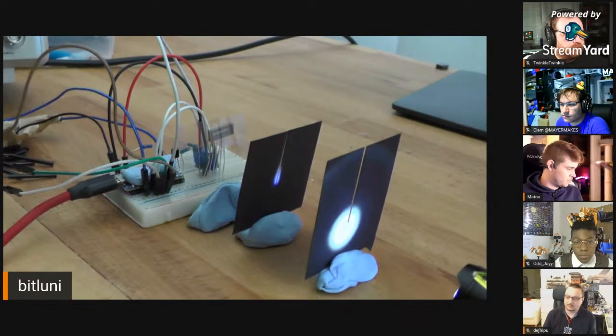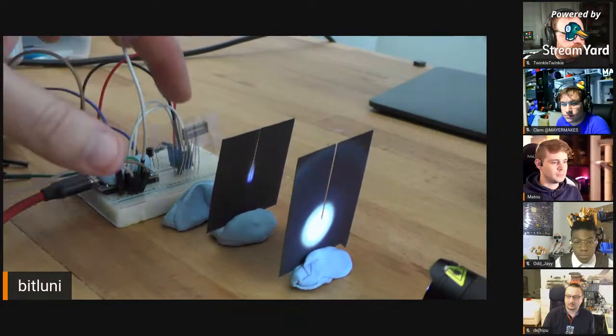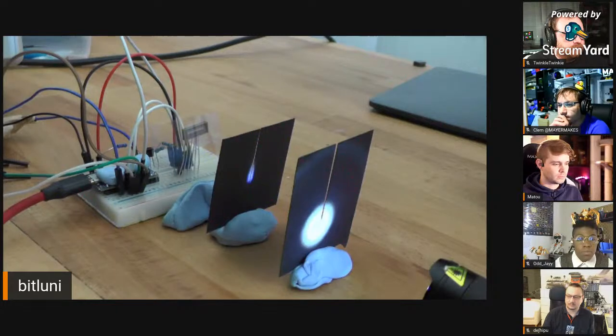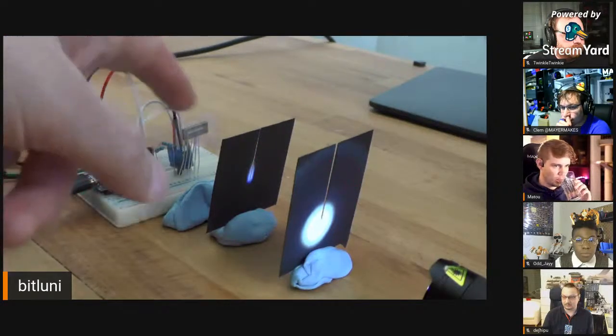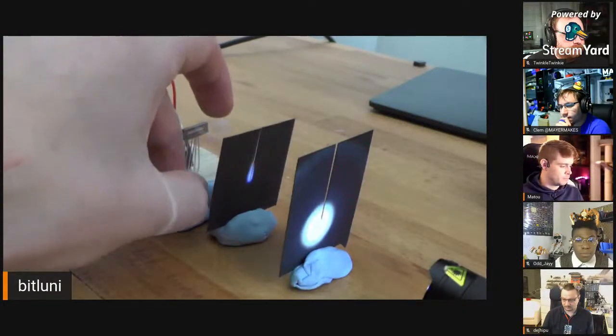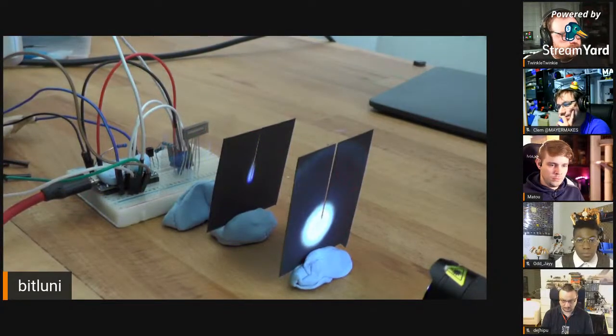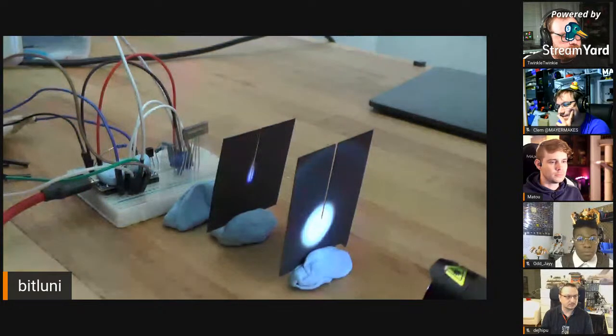And at the end, it should be something very, very cheap that can be easily rebuilt. The sensor from Mouser is $8, and from other sources you can get it for $3 or $4. There are even DIP versions of that. This is a surface mount one, which is bigger, but they're not easily sourceable in high amounts. And not many other parts. You get some 3D printed case and a $5 diffraction grating, and a microcontroller for $10. That should be all. And there's actually some software for PCs that others have already written, that does some calibration and displays the data. If that doesn't work, I can always write something on my own, and that uses the serial port. And I think that's all about this project.